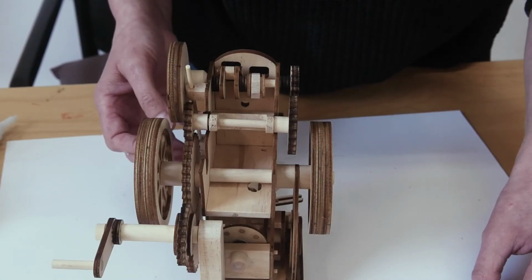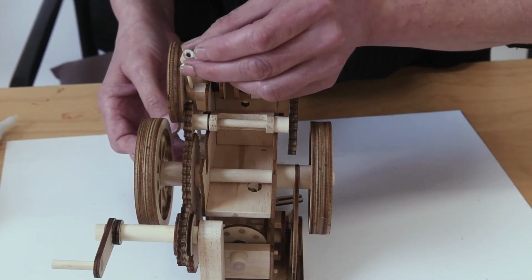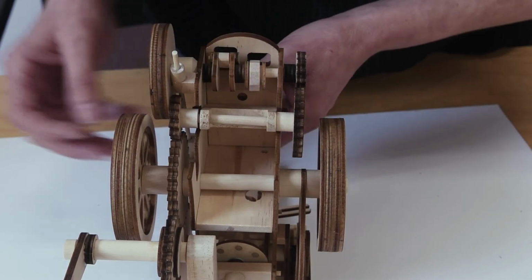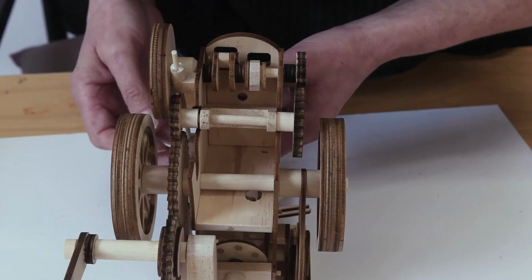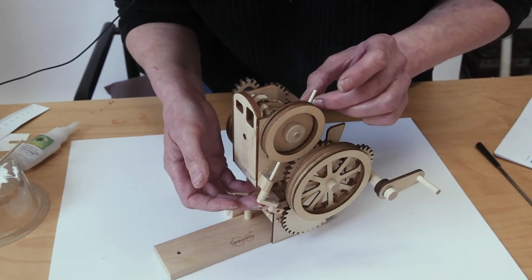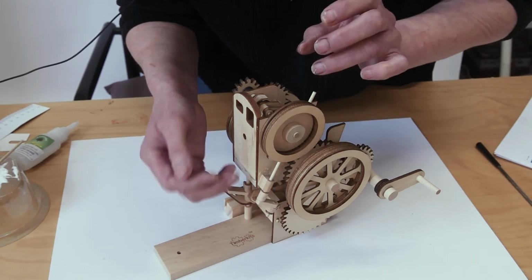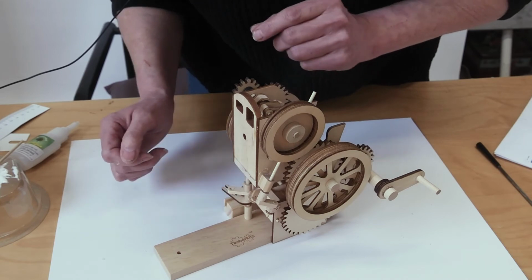So at the moment, as you can see with the two tabs in place, this peg can fall out, so you just drop that spacer down, put some glue at the top between the spacer and the peg to make a glue joint, and then make sure you've got this pushed fully up to the underside of that tab and press that down, not too tight, and that will then, when the glue's dried, hold that in place from that peg dropping out, and then just leave to dry for a good 15 minutes for these tabs to be firmly secure to the side.